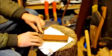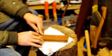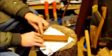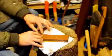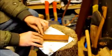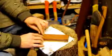So we can put the knife on the block, put our fingers near but behind obviously the cutting edge, and we can feel the blade pop up, and there should be a gap here big enough to maybe fit perhaps the edge of a 50p coin under there, and you can feel the blade sitting firmly and flat on the appropriate angle for the grind. And then all we're looking to do is gently begin to wear away material.